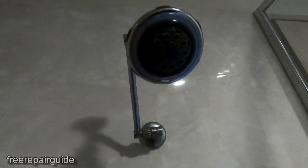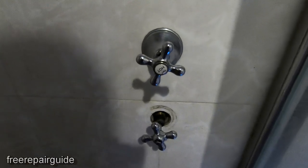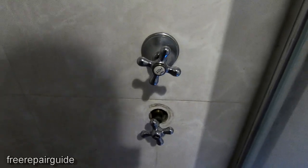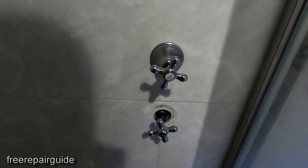Sometimes you might need to make the base clean before you can fix it. If there's a lot of holes or rust, make sure you get rid of the rust by using these tools here. Make sure you use these tools and grind it down to make it nice and flat, and that should stop the leaking. Using the tap seat replacement should work. If it's still leaking, make sure the base or the tap seat is ground down flat a little bit. You don't need to grind it all the way down — just enough to make the hole smaller so you have a nice flat surface and there's nowhere for the water to leak out. And that's how you can replace a worn tap seat without having to pull out all the tiles or knock down the tiles and replace new tiles.